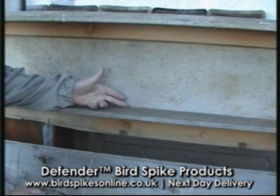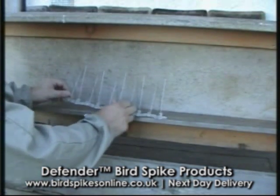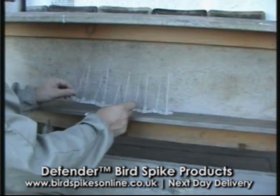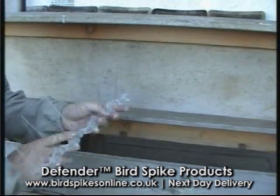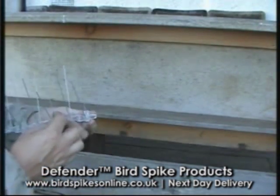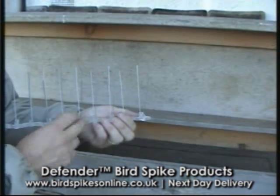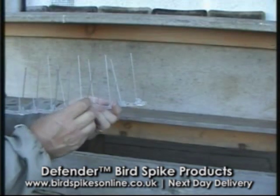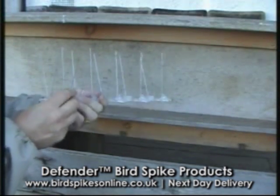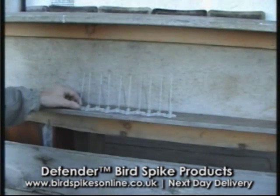Here we've got a very narrow ledge, it's less than 4 inches. We go to put the spike on and we're actually prevented because the back spike touches the wood at the back. All we need to do there, because it's quite a flexible wire, is just bend that upwards slightly. Or you could go along with some tin snips if you wanted and just cut the back wire off, but I just bend that up slightly. And now of course that will fit nicely even on the narrowest ledge.